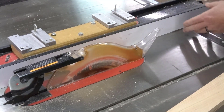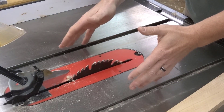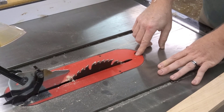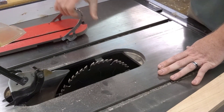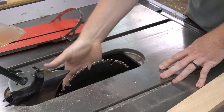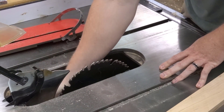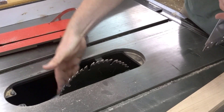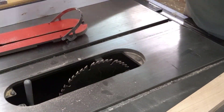Here's how you do it. First, move the fence out of the way and lift the guard. Obviously the blade is not running at this point, so please make sure it has slowed down and stopped already. Right here on the throat plate, lift and pull out. Now we're going to reach down on the right side of the blade — there's a door that if I push to my right, the door flops open. And then there's a handle right here, and this comes out. You can kind of see the handle now that it's gone — it just goes down and up. And that releases the guard right here. I can lay that to the side.